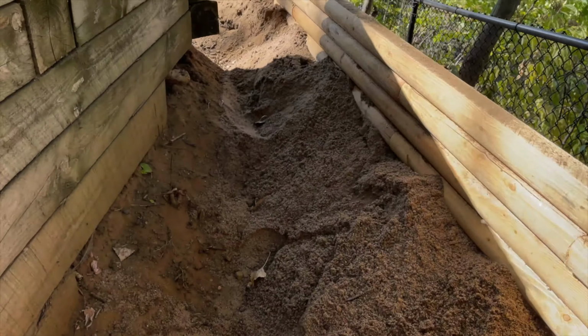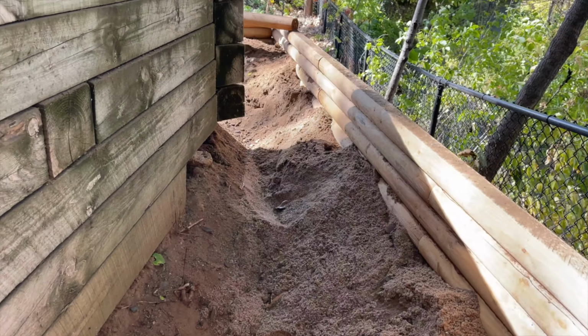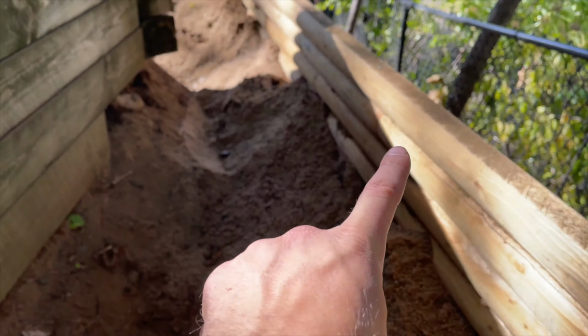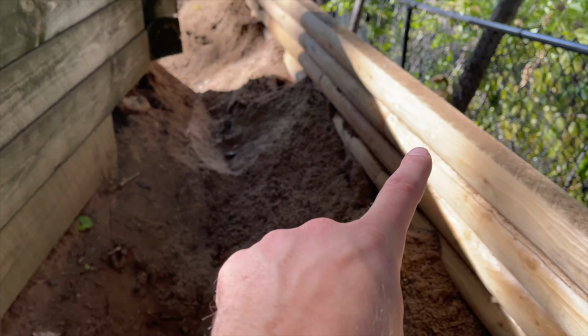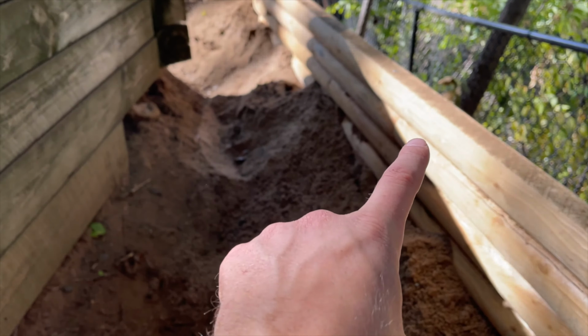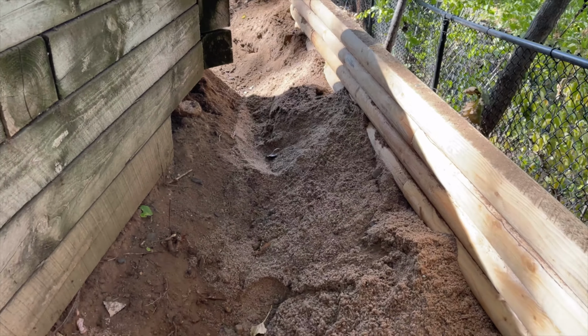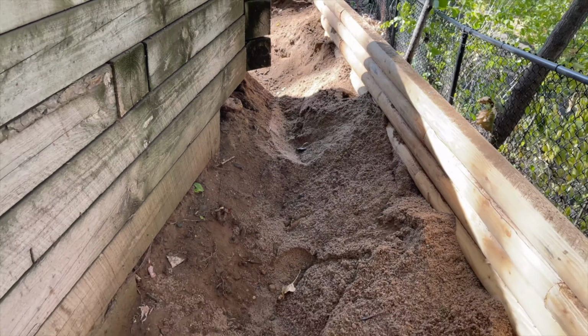And then what you'll do is put about 2 inches of good topsoil right on the top, leaving the soil 1 course below the surface. That way there's some room from right here, the top of the soil, to up here for vegetation and growth and other things like that. So this is how to put in a drain tile behind a retaining wall.